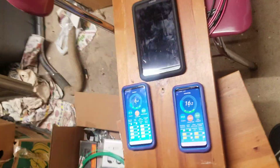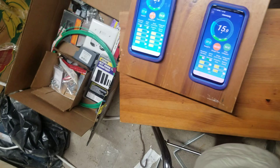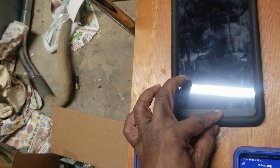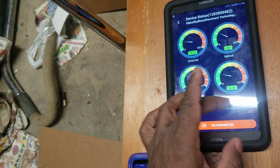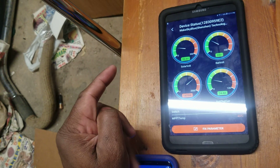I'm producing a lot of amps — 24. That 14 gauge wire can only safely handle up to 20 amps, no higher than 20. So at 24 amps, that's why the wire heats up a little bit.